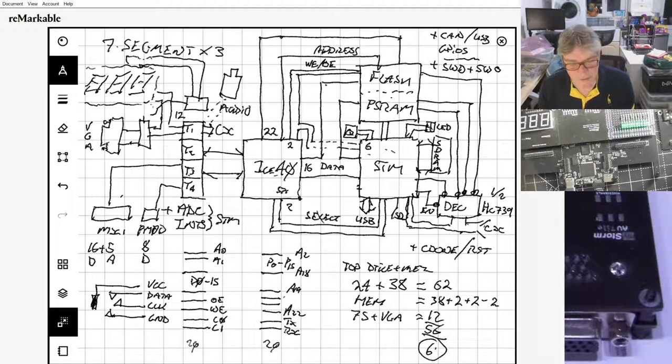And I'm looking at having 8 megabytes of SDRAM attached to the F7, which would be great when we want to run CircuitPython, because that uses a crap ton of memory. Otherwise it's no good, too slow. And the memory would be a lot faster than the access that you get on something like an ESP32 or something.